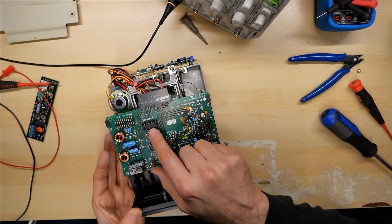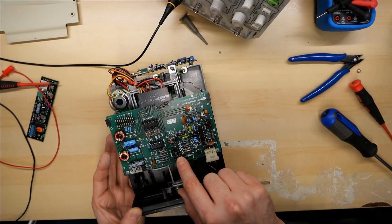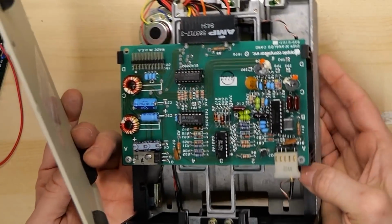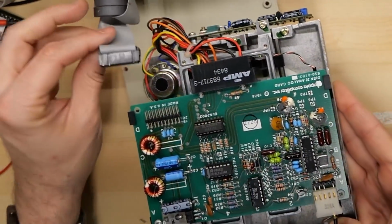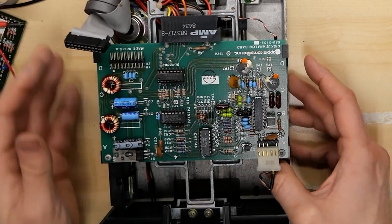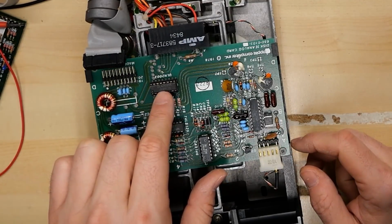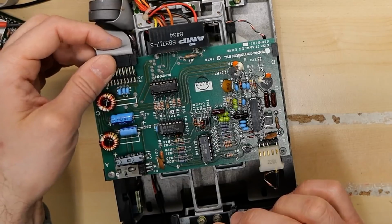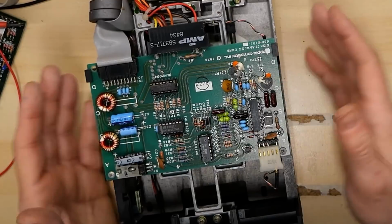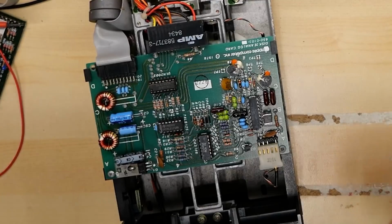That's the chip I swapped out, but that chip there has a 1981 date code, and so does that, and this one does not have a date code on it. Now, before I hook this drive back up to the Apple II, one concern of mine is that some of these other ICs are bad on here. And unfortunately, for instance, this one right here is a ULN2003. I don't have any of those spares. So if this drive is still not working, then it could be some of the other ICs got damaged, and I'm going to need to order those before I can fix this drive.